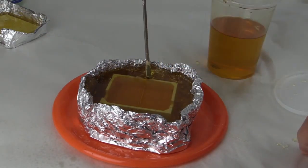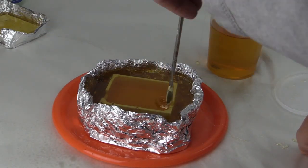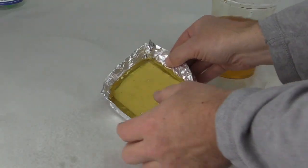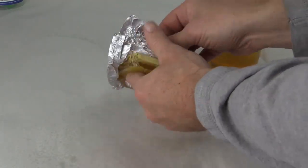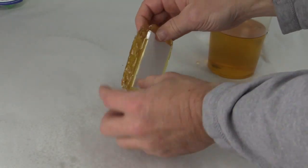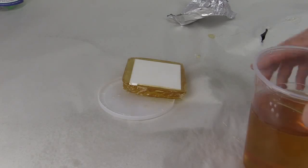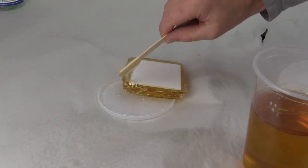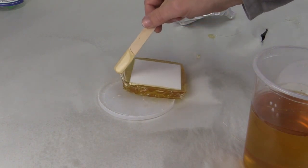We then put the mold in the freezer to cool. The large part took about an hour to cool; the lid mold was solidified in about 20 minutes. After pulling away the aluminum foil mold box, the top edge of the cover was found to be a little too low. So we added a little more composite mold by brushing it on with a stir stick. This saved us from having to remake the entire mold.